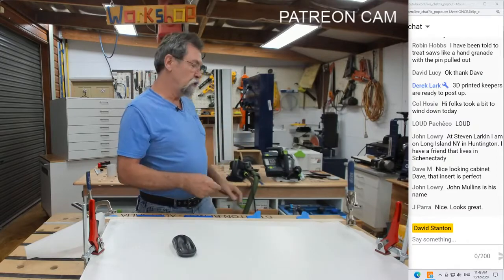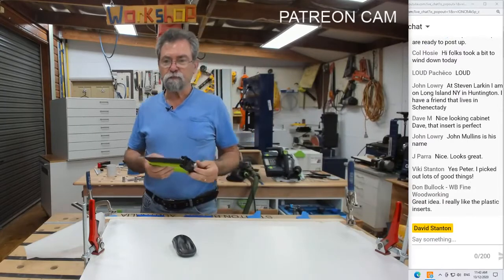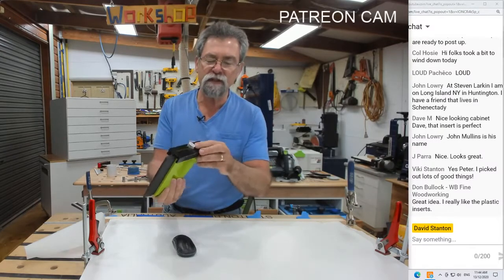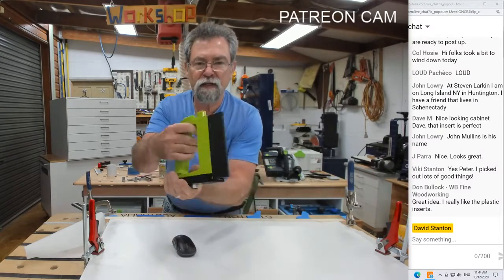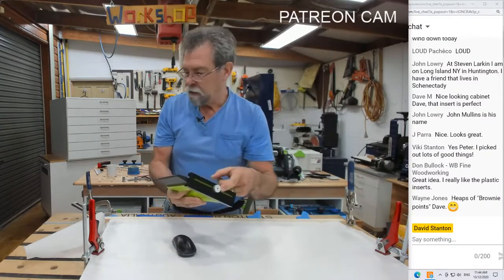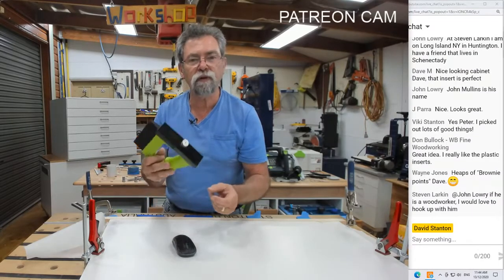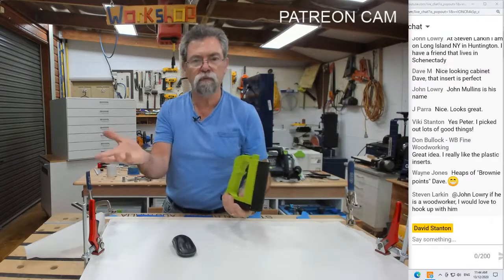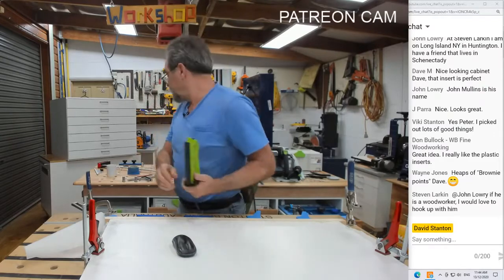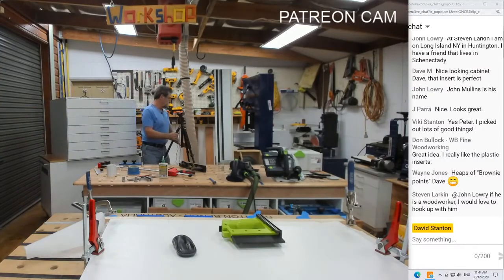All right, now we're going to go over to use this guy. Now, the thing is, this is a kind of an elliptical cam. As you tighten it up, it locks into your miter slot. It comes with two other smaller ones that'll go to 15 millimeters, 5/8 and 3/4 inch miter slots. So it works with a heap of them, which I think is a great idea. I'll switch cameras again. Well, I'll move that one first over to the bandsaw so you can see what's going on.